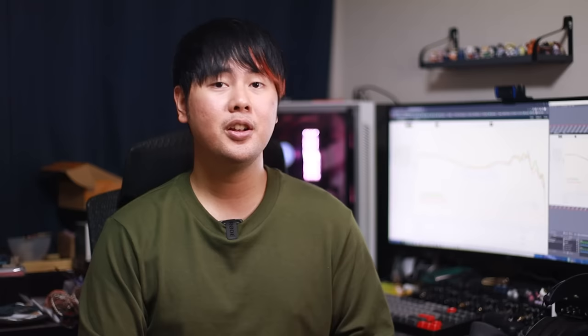The reason we don't auto EQ past 6kHz is because treble graphs are not accurate. As I stated earlier, how deep an IEM is inserted can affect the treble response. Not only that, the tips you use can and will affect treble response at the same time. Hence, the treble response you see on these graphs is not the most accurate representation of what you're going to be hearing yourself. Thus, it's not a good idea to auto EQ past 6kHz.